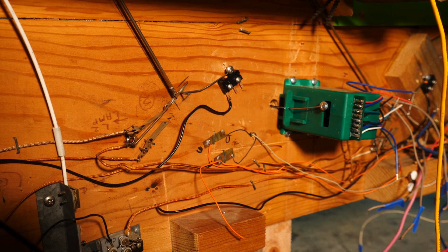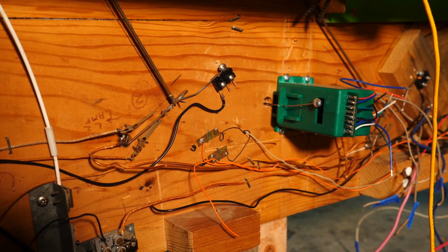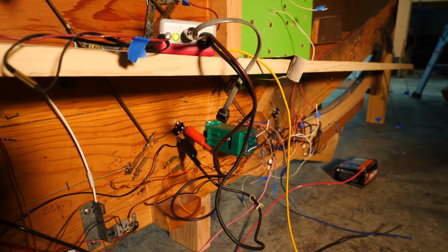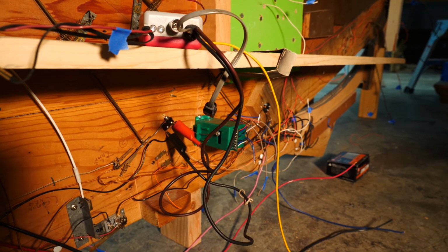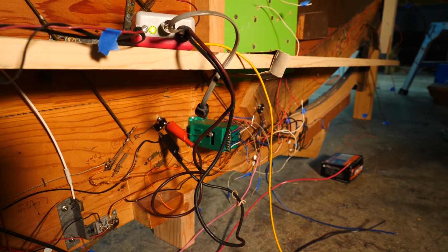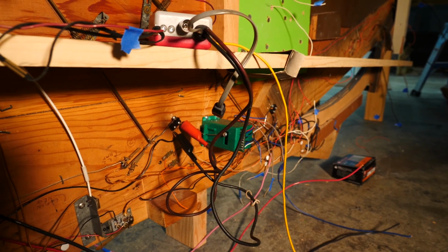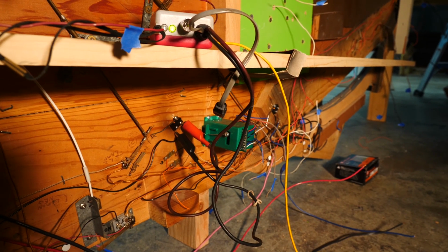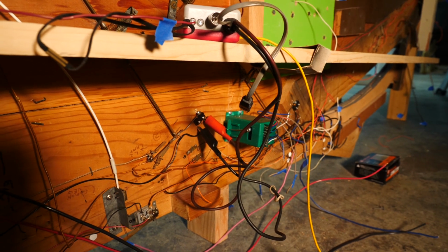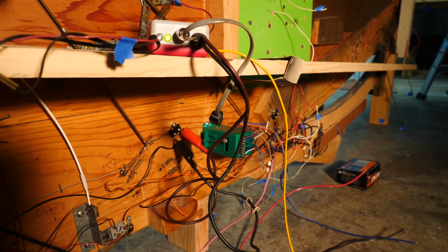So that is actually working. Let me show you that with the test light. So you can see I got a little test light up there now. On and off. So it's gonna flip the polarity from the one side of the bus line to the other, the red to the black in our case, and route power to the frog. So you see the green light up there working.